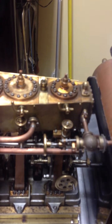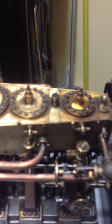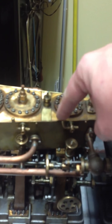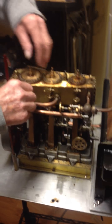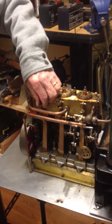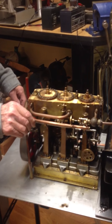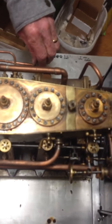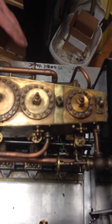You'll think it's not going to go, but once you get the pressure up and get the water out of there, then it'll go. These are the same thing — just get rid of the water at the top end of the cylinder, and these are the bottom end. So when I'm starting up, I crack these open a bit to let that drain out, and I let this water run into here and that water run into there until it gets going.